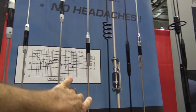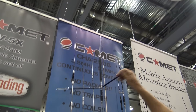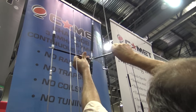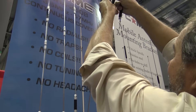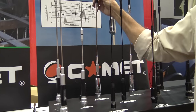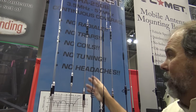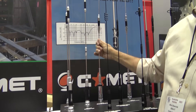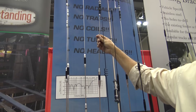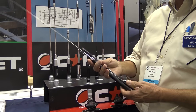This one here is a 40-meter antenna — it covers HF, 6 meters, 2 meters, and 440. Comet does make something for HF! This is Comet's HF, 2-meter, 440 mobile antenna. The main mast covers 6 meters, 2 meters, and 440. If you're just driving back and forth to work or the grocery store, 2 meters and 440 is all you need and the antenna stays small. However, if you're going on a trip and want to be on HF, you can grab any or all three of the HF coils and just attach them.